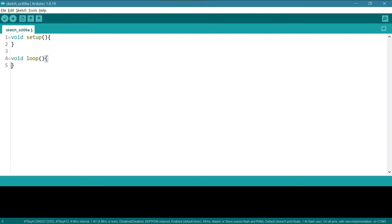We won't write software today because it's already there. I'm using Arduino IDE 1.8.19 — this should be the same in the 2.x IDE. First, you want to program the Nano to act as the programmer. Go to File, Examples, and find the Arduino ISP example. Select that — here's your programmer sketch for the Nano.